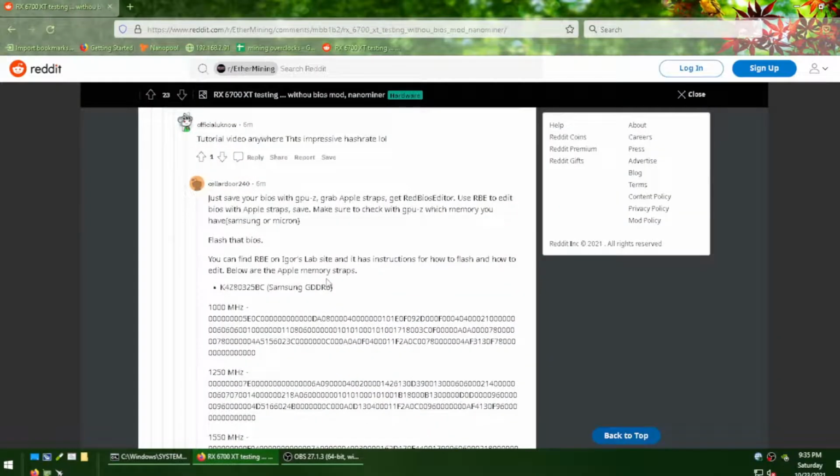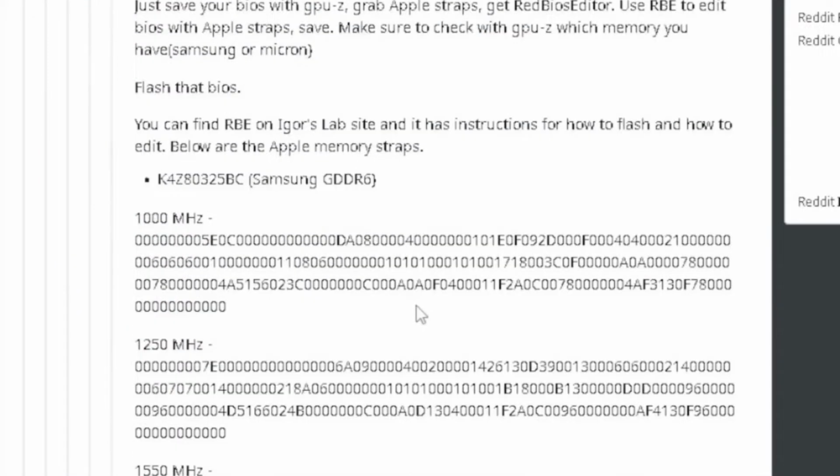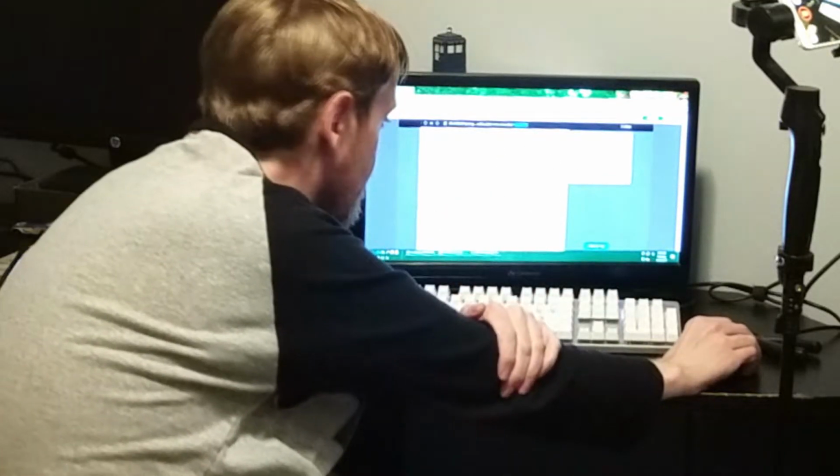Because look, this guy's like, I'm also at 58 mega hashes on Ethereum, and he even puts his clocks. I modded the BIOS with Apple memory straps. And then he says the actual straps there, and I couldn't get it to work in the last video.